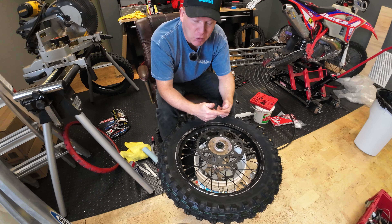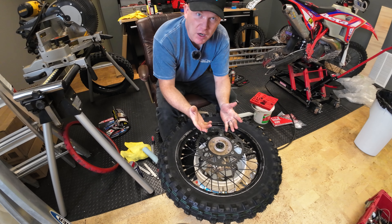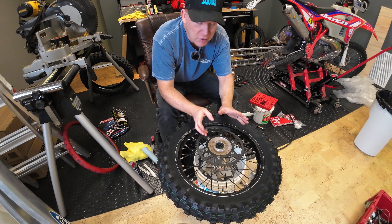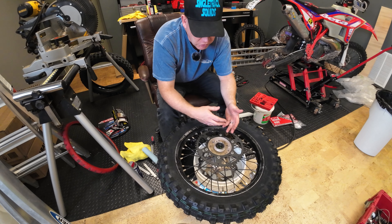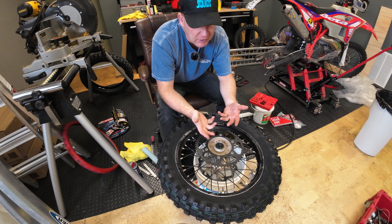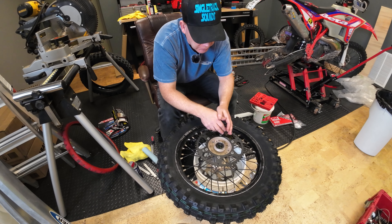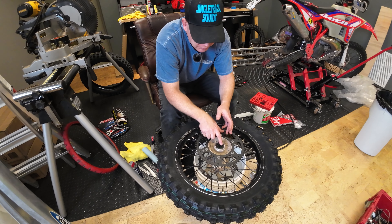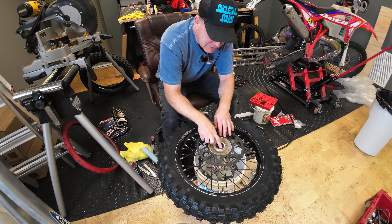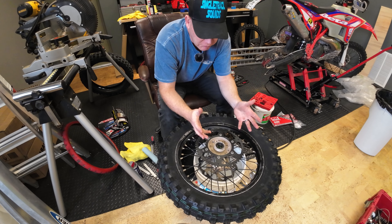You can pick the type of bearing you want — a China bearing, a Japanese bearing, one made in Germany, whatever you want. If they have it, you can pick where you're getting that bearing from. You can get shielded bearings, which would be for a heat environment because you can't have the rubber on the outside, or I just got a normal one that has the rubber, the dust seal, whatever you want to call it. You can get open face bearings too.